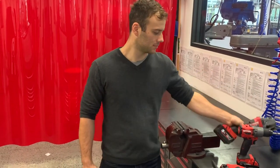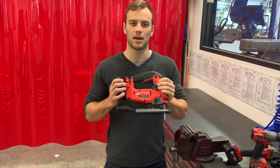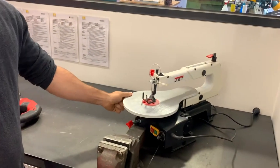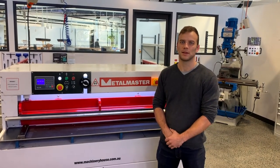We have a range of power tools, including the angle grinder for general cutting operations on metals, the hand drill for general hole drilling capabilities, the jigsaw for cutting shapes into sheet metals, and the scroll saw for cutting more intricate shapes into delicate materials. The guillotine can quickly and accurately cut sheet metals down to size.